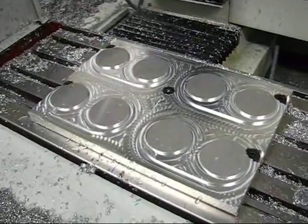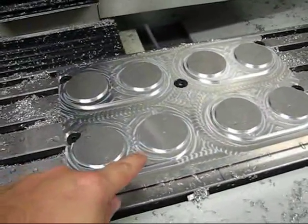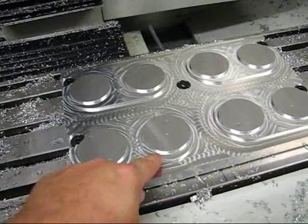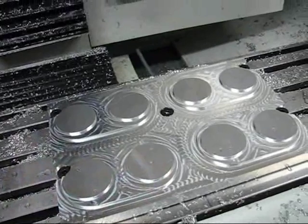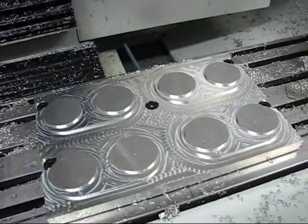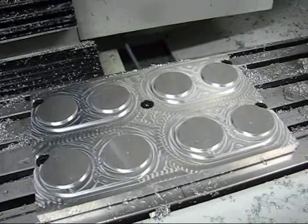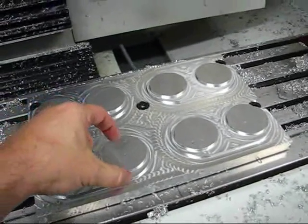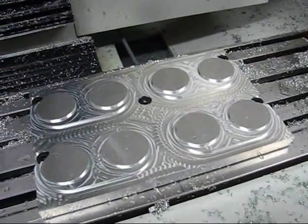The first step is complete and I'm getting ready to start the second, which is going to involve the finishing operations — the surface finishing operations of this surface on all four — and then it'll do the profile around each of the bosses. That's not the final profile; that's coming next in the operation after I measure each of the bosses so I know exactly how big they are, and then I can adjust the size accordingly.